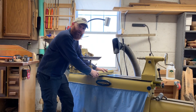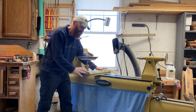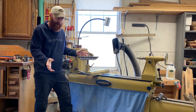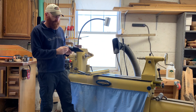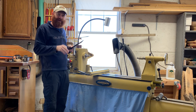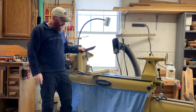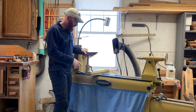This is the banjo — right here is called the banjo. So when they say 'above the banjo' or anything that mentions the banjo, that's what this is. It simply slides to all positions and then you can lock it down. Here's the tool rest, and this is an important measurement — mine is one inch. Different banjos have different sizes, so it might be three-quarter inch, half inch, or an inch and a quarter. This one is an inch, so if I ever buy a tool rest, I need to get a one-inch tool rest.